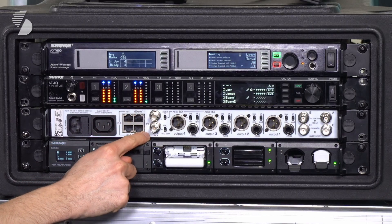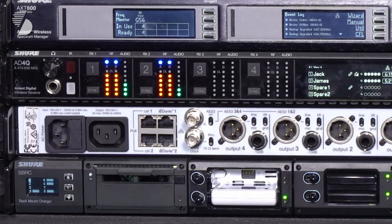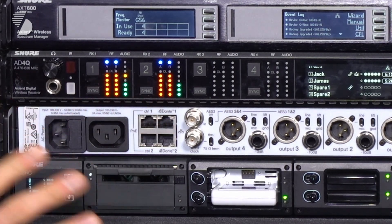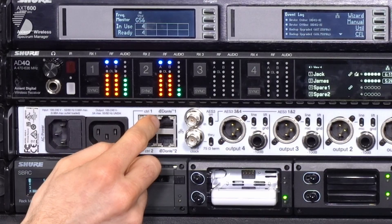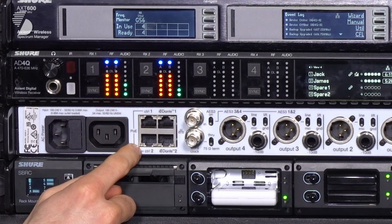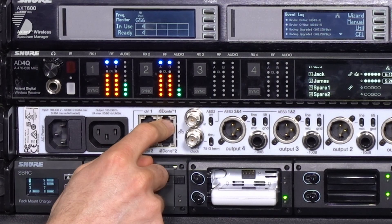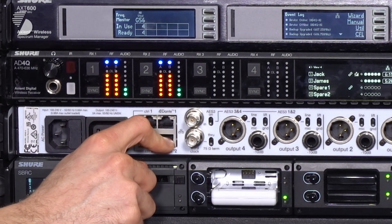So to get this right, first of all we need to talk a little bit about this four-port Ethernet switch on the rear panel. This four-port switch can be used in a number of different ways depending on how you want to set your network up and what it is you're networking together. We're dealing with two types of data in this switch: the Shure control data, and we also carry both Dantes here as well. So out of the box in its factory reset mode, Shure control data lives on the two ports on the left hand side, which also carries Power over Ethernet. Keep that in mind. And the two ports on the right: the top one is for primary Dante and the bottom one is for redundant Dante.